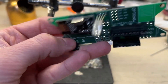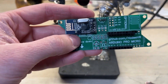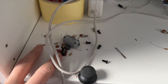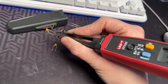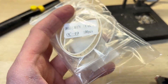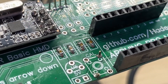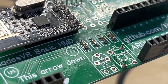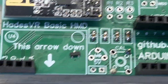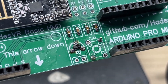I've connected the wireless module using regular gold pins — it's a pretty solid connection. Turns out I don't have any capacitors in stock. I've tried looking for some spare ones in my garbage pile, but I didn't find anything. Thankfully, I forgot that I just ordered a whole package. My capacitors are SMD, which means I had to slightly improvise. My voltage regulator is SMD as well, which means I will have to do the same thing as with the capacitors. It doesn't look too bad — it was super easy to solder.